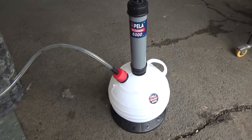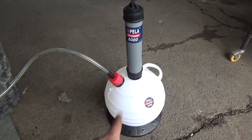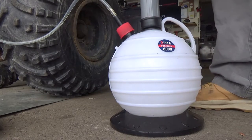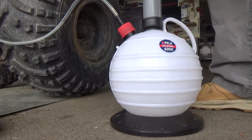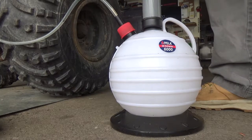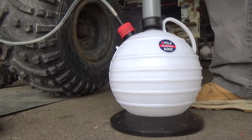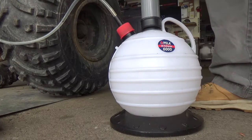We're not going to be extracting oil until you get about 10 to 20 pumps into this thing. I'm going to start pumping it up. There's no pressure when you're pushing, it's only pressure when you're pulling, because again you're applying a negative pressure inside of this tank.